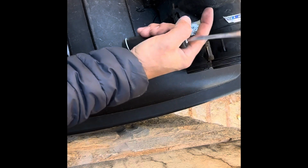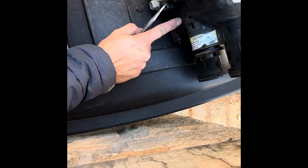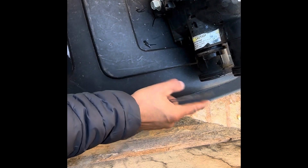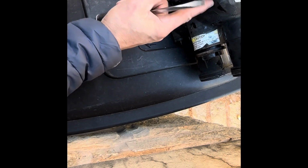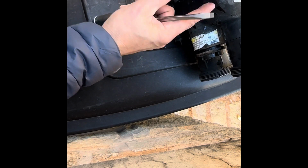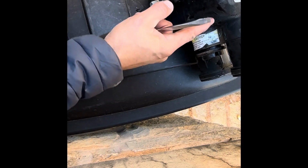So the water comes into the heater from the top here, goes through the heat exchangers back here, and some of the water goes right past through here and goes right back to the pool. It just goes this direction, but the bypass valve, when it gets too hot, lets more bypass, and less whenever it's cooler.